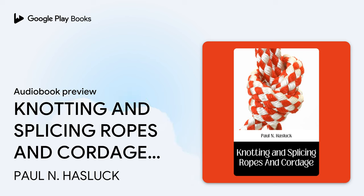The maximum safe load on a rope depends on many circumstances, such as quality, age, and dryness of rope, nature of load, mode of lifting, etc. Approximately, the safe load on a new hemp rope in hundredweights with direct lift is three times the weight in pounds per fathom. On a sound old rope, one-half the square of the circumference is sufficient load. A Bessemer steel wire rope will safely carry in hundredweights three times the square of its circumference in inches, and a crucible steel wire rope four times the square of its circumference. For hemp ropes the minimum diameter of sheave should be circumference of rope plus two, and for wire ropes the diameter of sheave in inches should be equal to circumference of rope in sixteenths.